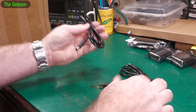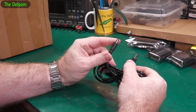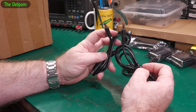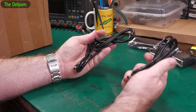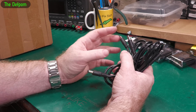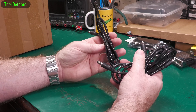Cables — these are some high-current ones. These are 18 AWG, so higher current than standard. 2.5 by 5.5 millimeter type cable — I think that's 2.5, probably 2.1, I don't remember. Sometimes 2.5 will fit in a 2.1 anyway. These are 1 meter cables. I've got some of these before and they work quite well. It means you get less voltage drop being a bit more robust, and if you're trying to do higher currents like a couple of amps or so, having a higher current rating on the cables is a good thing.